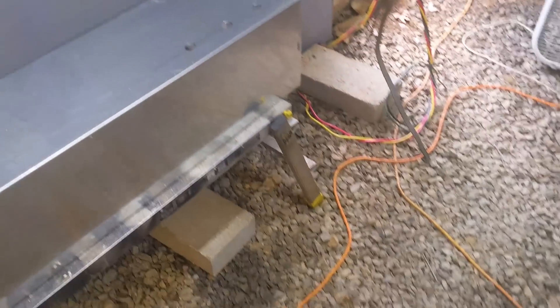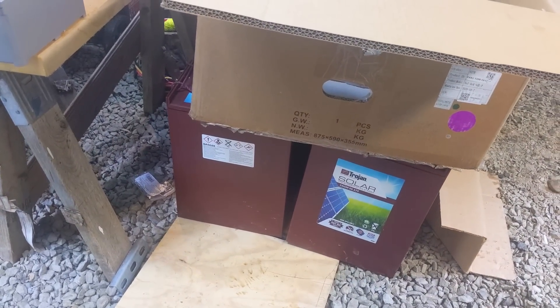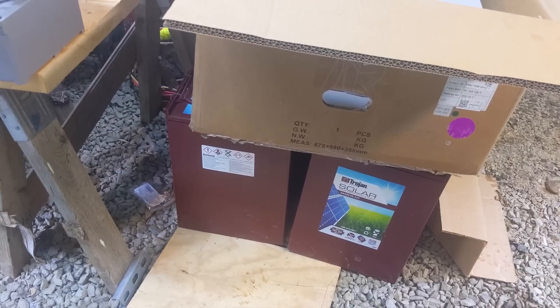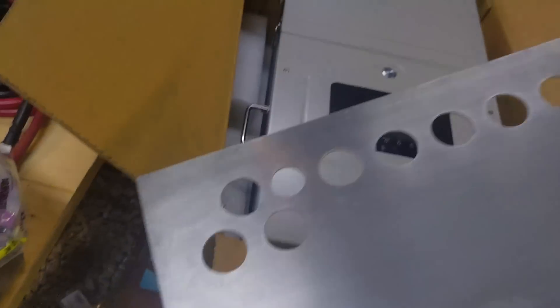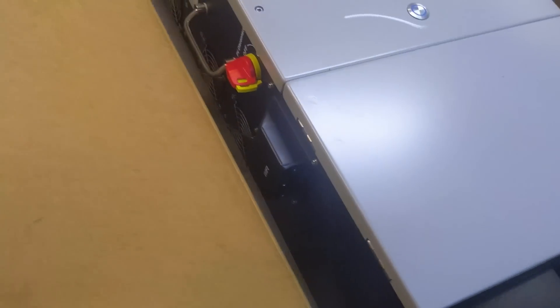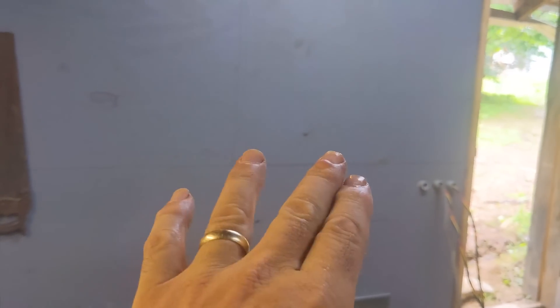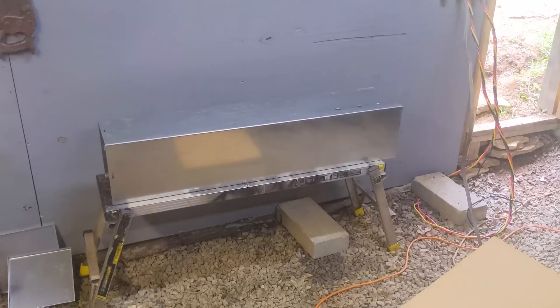We're about to put up a 10-inch gutter here in his shop to feed the house. We'll have a critical loads panel in the shop. He was able to get these Trojan batteries — he can always change them out later, but they were a really good deal. We were doing a swap-out where a customer wanted lithium, so there are not a lot of hours on these batteries. It's a great start: a 48-volt set of Trojan Solar AGMs. They used the same case, which means our template fits the bottom of the inverter, making the install a little easier.